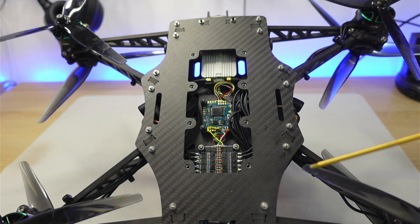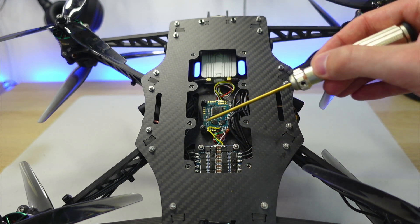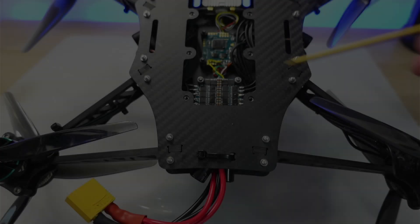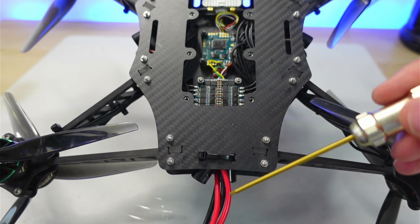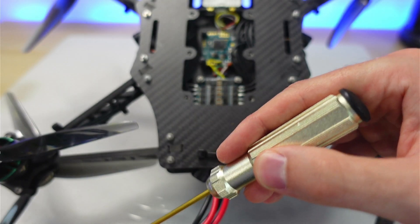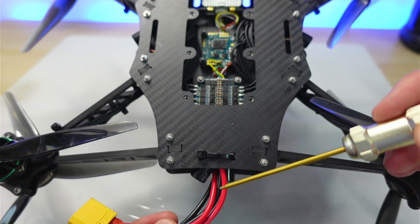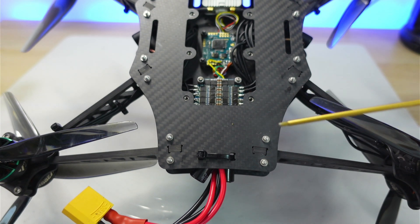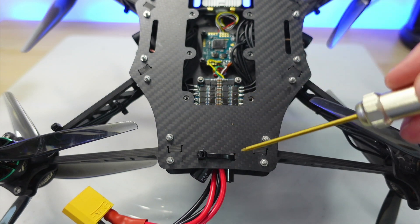If you're building out the Cine 80, I'd advise putting both 4-in-1 ESCs on the rear stack, the flight controller in the middle, and whatever VTX system you prefer up front. That makes it easy to route your battery cable out of the rear of the drone. I've used two wires — one to each ESC — onto a single XT90 connector. Using two thinner wires rather than one thick wire makes the cable more flexible and easier to route. There's also plenty of space to mount large capacitors on your ESCs.